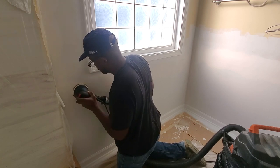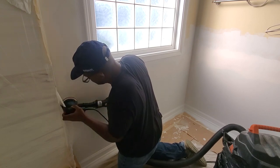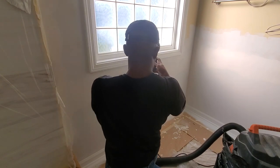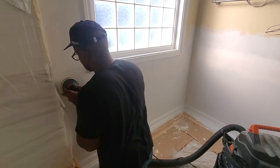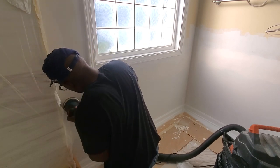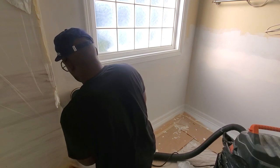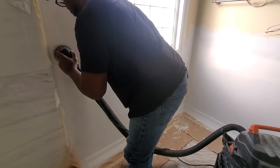Along this wall we're meeting our tile shower enclosure — specifically the fiber cement board beneath the tile — and we're going to float the edge where those two surfaces meet. We have metal edging there as well. The tile has already been installed and we've got masking film over all the tile with tape along the edge to make sure we don't get dust on our finished work. One of my pet peeves on remodels is once work is done, getting it dirty and requiring extensive cleanup — that's a waste of time and money.